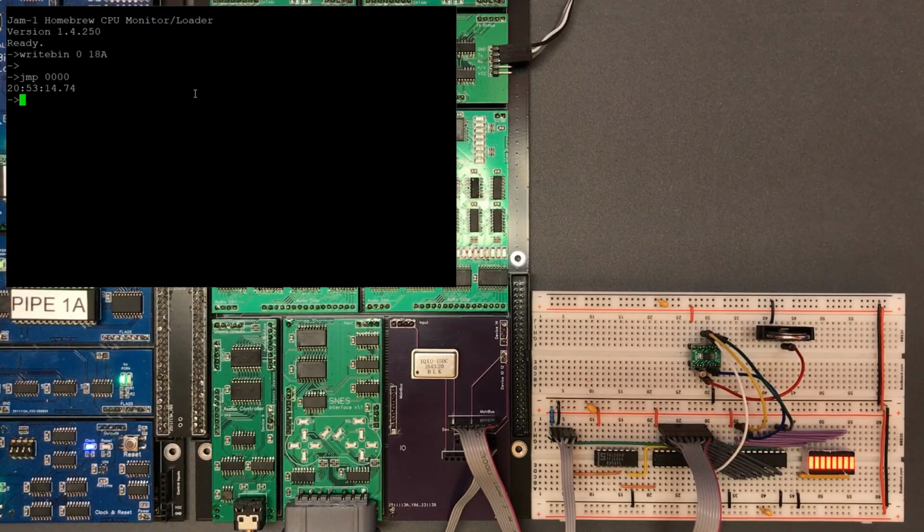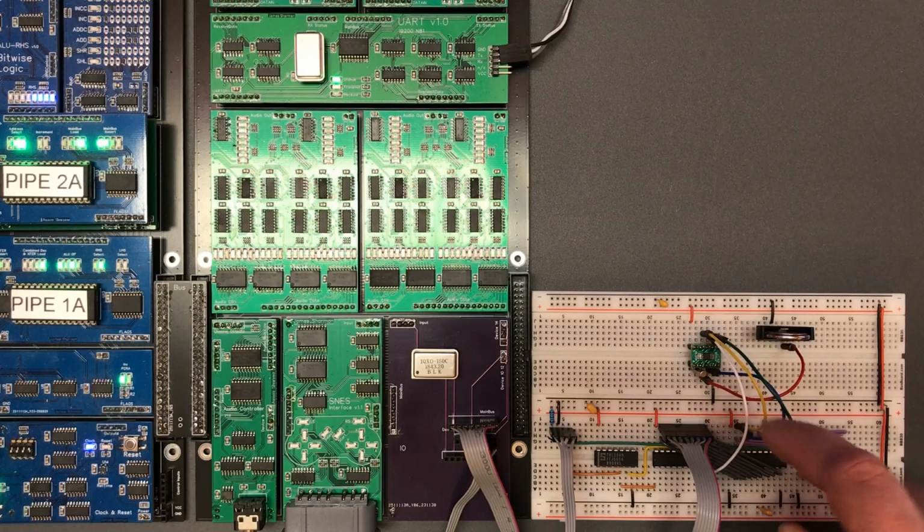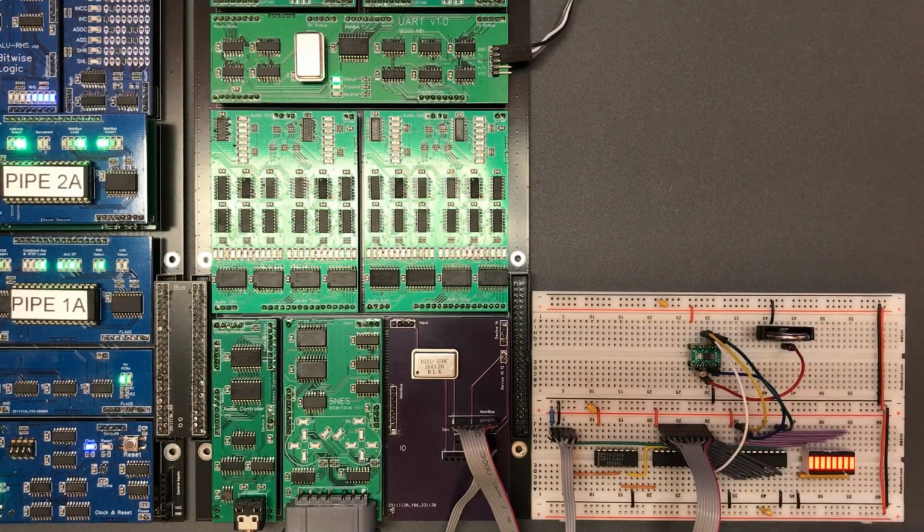So that says 853. Now it's currently on my PC showing 850. So the clock's definitely running slightly fast. It's gradually gaining a few seconds. I should probably set it exact and track it for a little while just to confirm. But I'm more interested in doing that after I've replaced the crystal, put it onto a PCB so everything's directly connected. There's no issues about the battery source, etc. But it'll be interesting to see just how accurate these chips are.